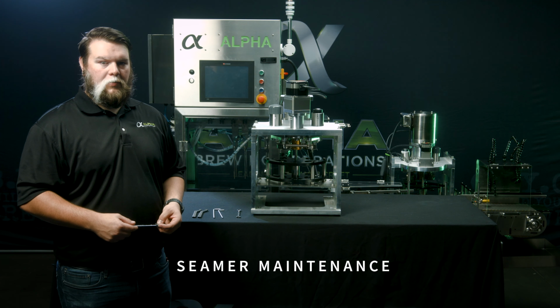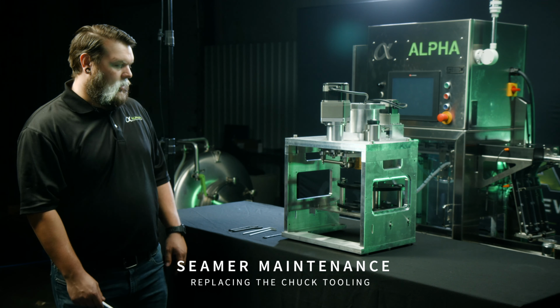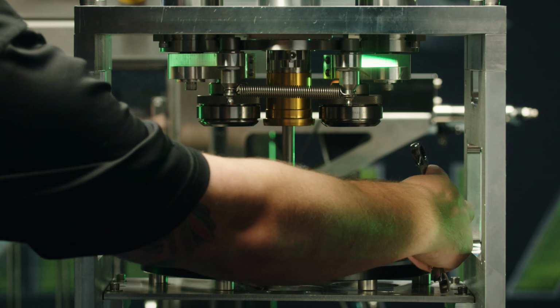To replace your chuck tooling, the first step is to remove the can guide from inside the seamer. To do that, with a half-inch wrench, you'll remove the outside two bolts.